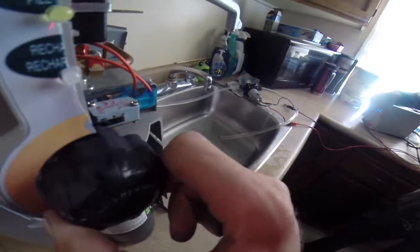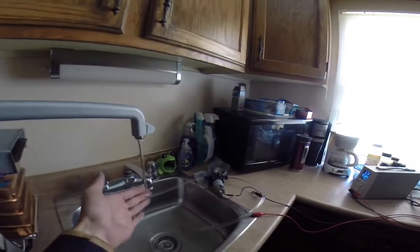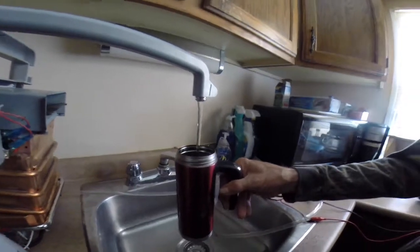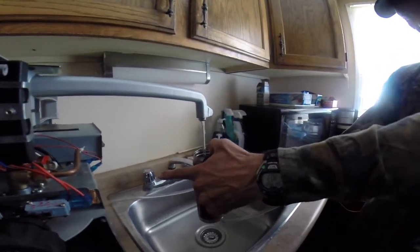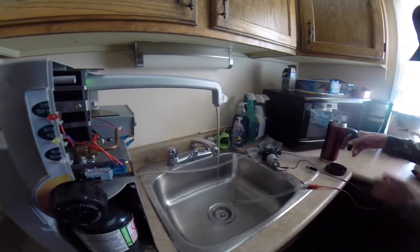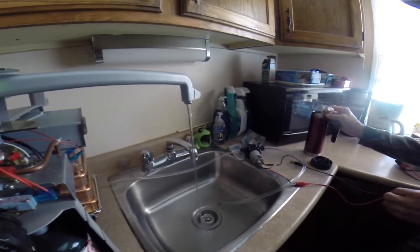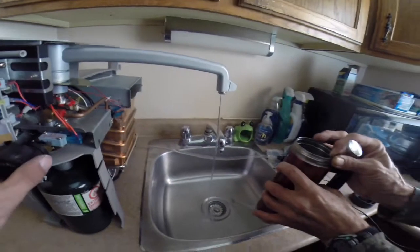The machine is set up. We have fire — we've got heat back there and the water is hot to the touch. It goes over-temperature pretty quick, so maybe I'll turn that down. I've got a thermometer. Maybe it was just set too high, but she does appear to be working. If you want to turn the water off, crank that off. Pump is working and we have heat.